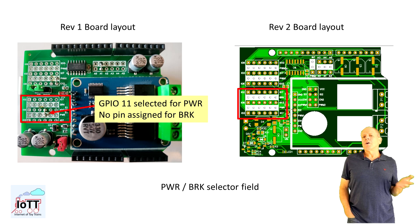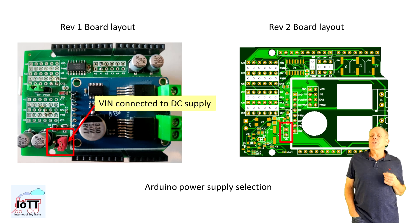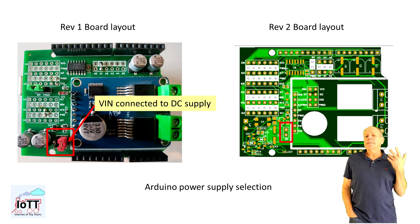If you are using an Arduino Mega and want to use one of the additional IOs, you can simply run a wire from the center bar to the IOPin you wish to connect. There is one final jumper labeled VIN — if you set this jumper, you connect the DC input of the IBT2 to the VIN wire of the Arduino, which allows you to conveniently power the entire stack from one single power supply.